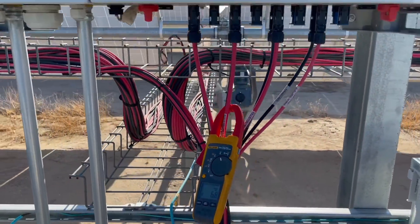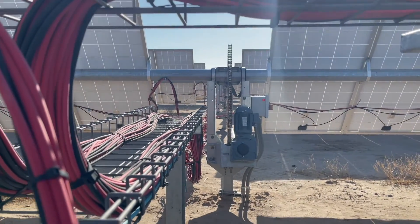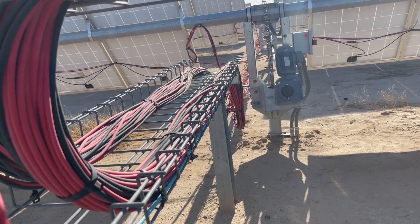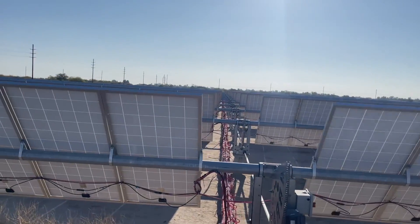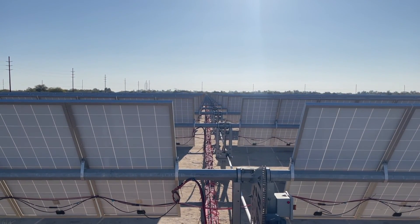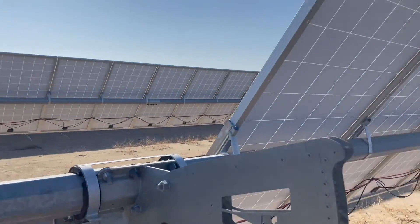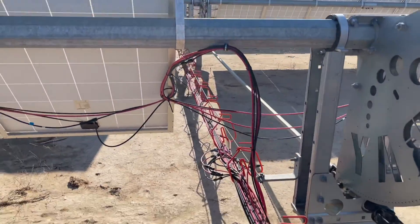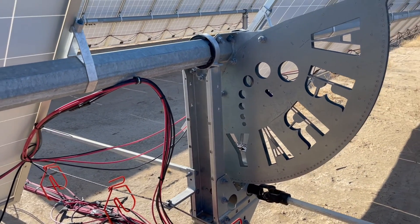With my amp meter I have to go down and follow this basket of wires down many rows, checking every row where the wires peel off out of the basket and go down over to the modules right and left. There are about 28 rows all the way back to the inverter, and each one has three strings — or six wires — peeling off to service each row right and left.